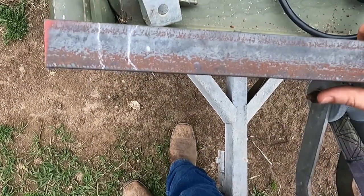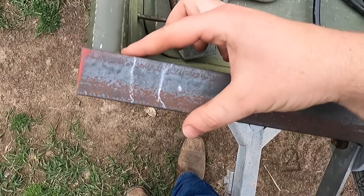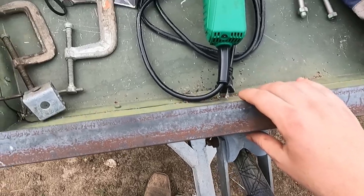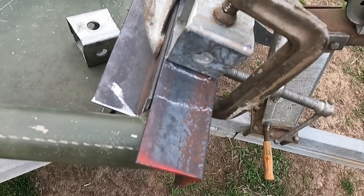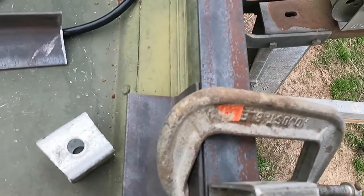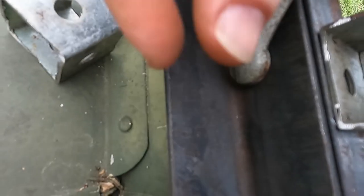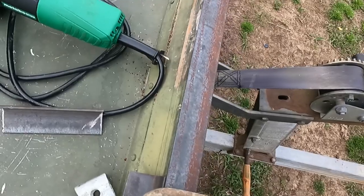I got my centered lines on it. This line will be the edge of the light bar — I just came in an inch from each side from where this tubing is, and that's how big my light bar is, where it'll be centered up. So we'll go ahead and start getting all this together and show y'all what it looks like. This is basically how everything is going to be mocked up. I'm going to run a bead down through here and weld this piece of tubing on here as well, that way I can run a bolt through for my light bar. I'm going to drill a hole through here so I can run a screw or bolt through it to clamp it on, the same way the C-clamp is working.